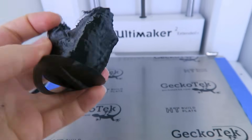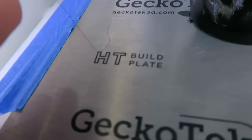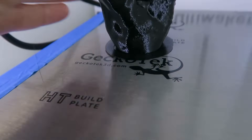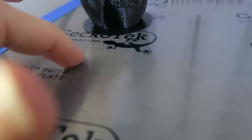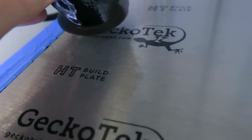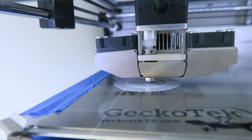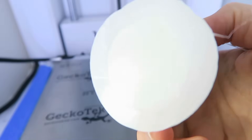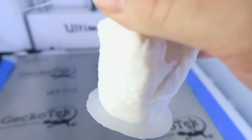This is absolutely the best result with polycarbonate that I've had so far, and it's on a surface that doesn't even advertise itself as being for polycarbonate. Now that I've revised my settings, I don't see any damage to the surface whatsoever — other than just the same slight little changes in coloration from other prints in different filaments. There was a little bit of damage where I had it over-adhered, but I don't think it's going to seriously impact the effectiveness of the plate. Beautiful — that's the PC Max, no cooling fan, bed at 60.